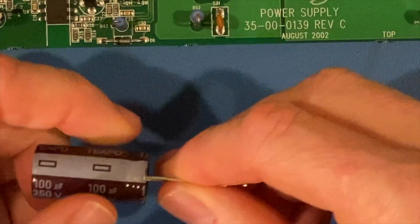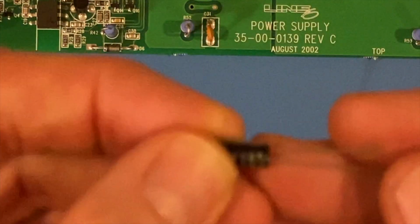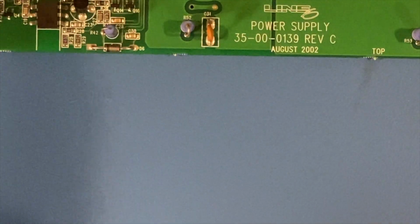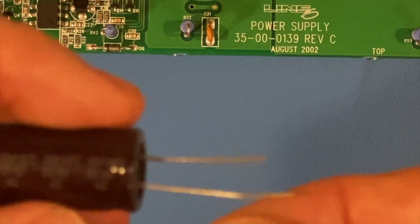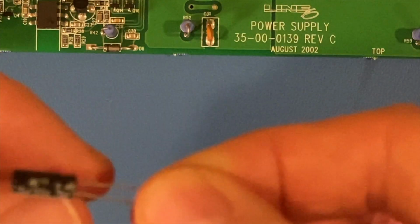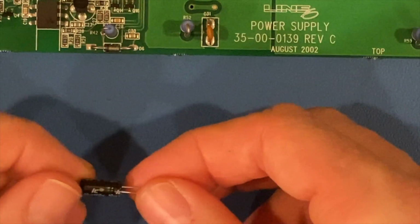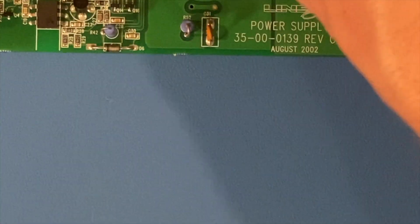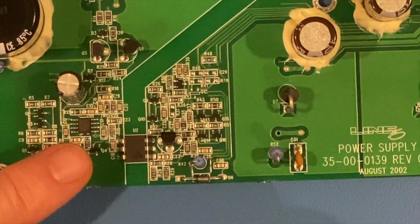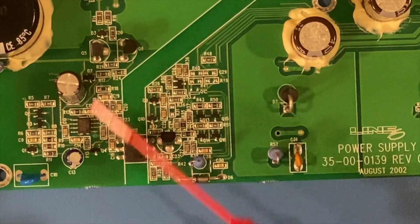So the silicone helps to keep that item in place, whereas with something small like this, you can see, in ratio, these leads are actually thicker for the size of the body than these are for this. The holding power, because this is a much lighter component, the stresses that will happen laterally through vibration are so much less. So you see that they didn't put any silicone on this small capacitor here, or this one here, because they are smaller.